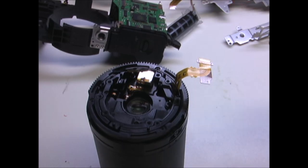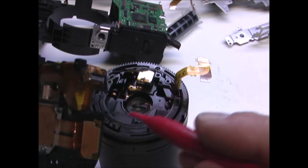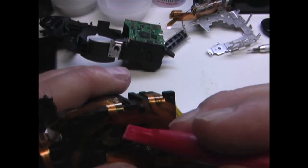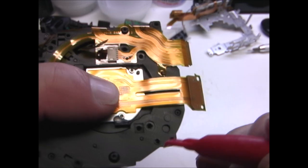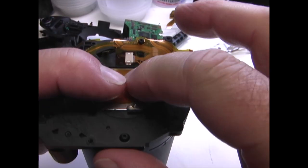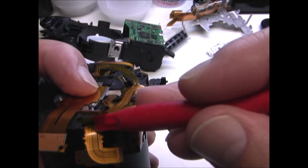To reassemble the camera, start by putting the back on the lens. This ribbon cable right here has to go back in through this slot and come up and go through there. This cable on this side has to fit through here. Now with the back in place, you can see this ribbon cable is sticking through this slot. To make sure that you have the back located correctly, there's a pin here and here and another one up here — you should be able to see those through the back and then you know that it's in the right location and fully seated on the lens. Then make sure that this cable isn't getting pinched between the lens and the back of the cover.